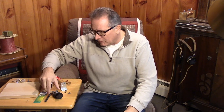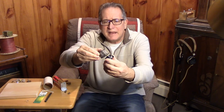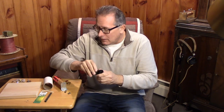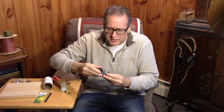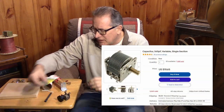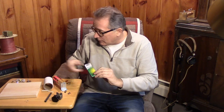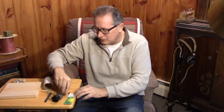The first part that scares people is the variable capacitor. This is the apparently unobtainium 0-to-365 or 0-to-410 picofarad single-rotor variable — the one everybody wants for their crystal radio. It costs $17.50 plus shipping, so that's out. This time we will substitute for this after getting it working with the variable, and we will use a varactor diode with a cheap potentiometer to attempt to tune the crystal set.